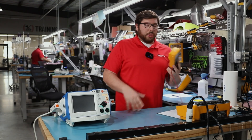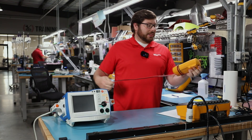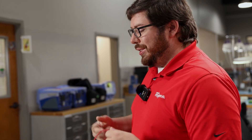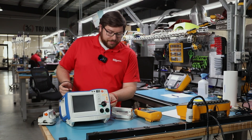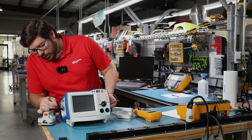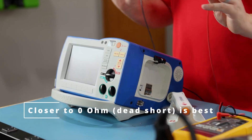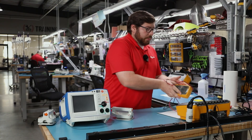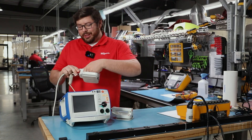The first thing we're going to need is a multimeter. I like to set it to resistance, and we're going to test the paddle well connection to make sure the internal resistance is measuring adequately according to OEM standards. I'll take these paddle wells and open them up, put one side on each terminal. Right now I'm measuring 0.2 ohms, so we are good — I usually don't see them go past 0.5. I'll put the multimeter away and disconnect my paddles.